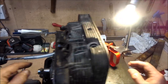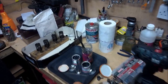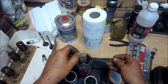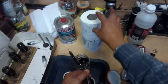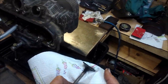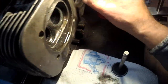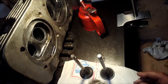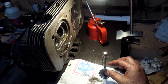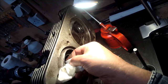With the machine disconnected we can now remove the valve - see it's got the stuff all the way around it. This will clean with thinners, and as you can see already the valve seat is grinding. Compare that one - the untouched one - see? Now we can have a look at the valve seat itself.